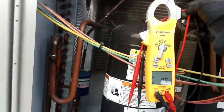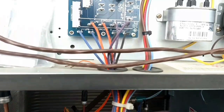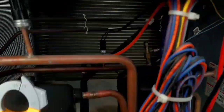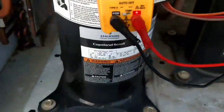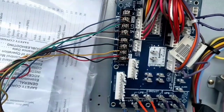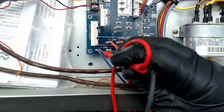I started checking because the compressors aren't running. I started checking my switches here for my safeties. This is a high pressure switch for circuit one — zero. We got the low pressure at 47, so that's open. We got a low pressure switch right here, and low pressure for circuit one — that's open. So they're going off on low pressure.